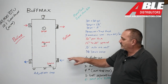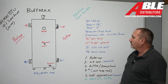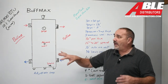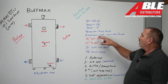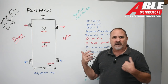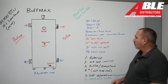The 30 gallon has inch and a half threaded connections, in and out on each side. The 50 gallon has two inch connections. There's a pressure and temperature gauge — I like that, it tells you what's going on in the system and in that tank, so it's always a good diagnostic tool. There's an immersion well for an Aquastat or a sensor. I kind of like the idea of an Aquastat — set it there, just treat it as any other zone, no demand, no need to do anything more complicated.